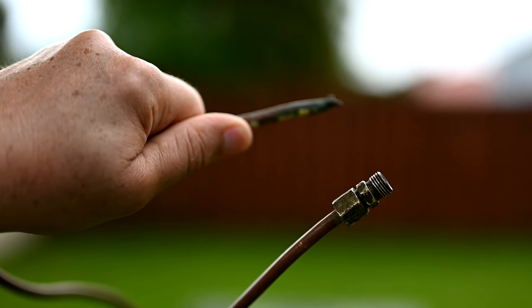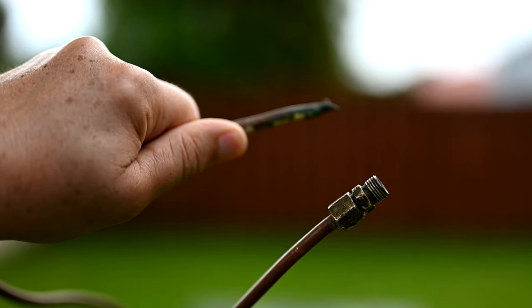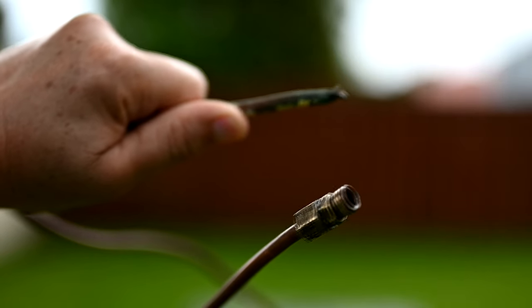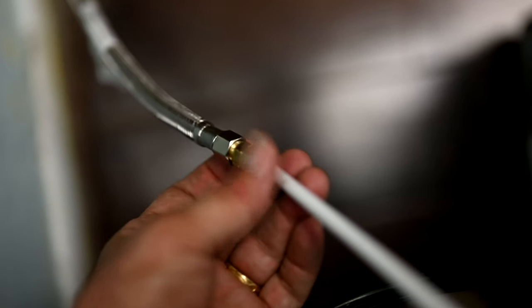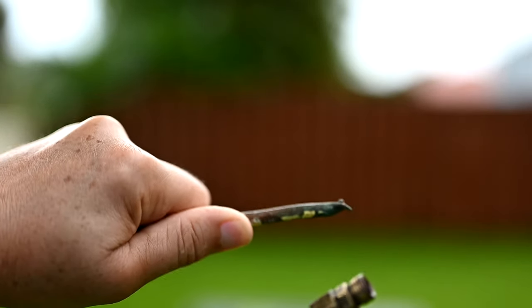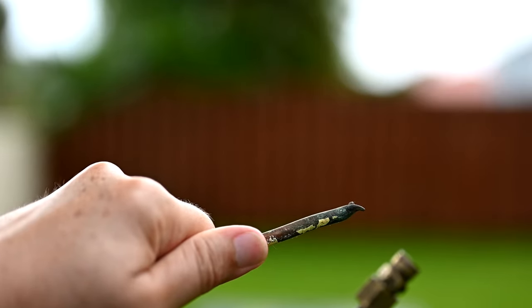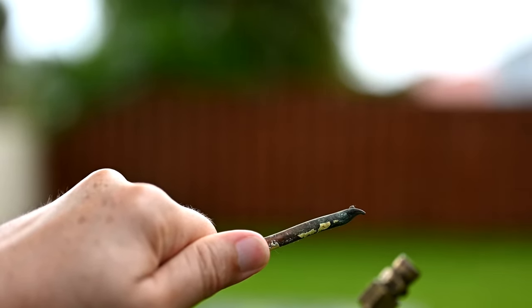Here's what it looks like close up. There's usually a plastic hose or tube on the back of your refrigerator that plugs into your water inlet port, and this is how the water gets to your refrigerator. That hose has a nut on the end that screws onto this threaded component. You can see here close up where the damage occurred — if you put too much compression on these copper tubes, they'll just bend, twist, and shear off.